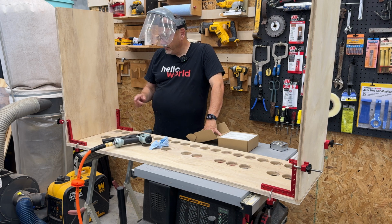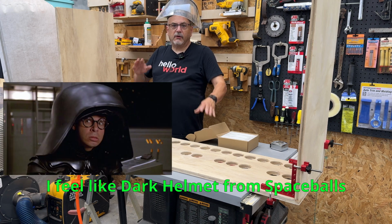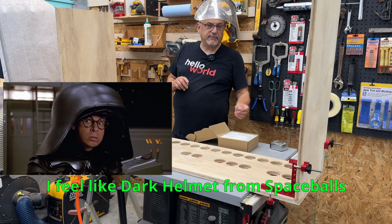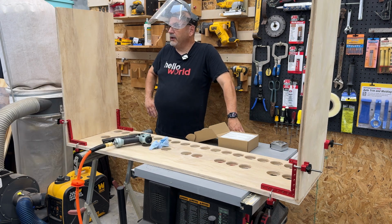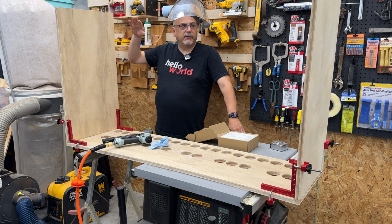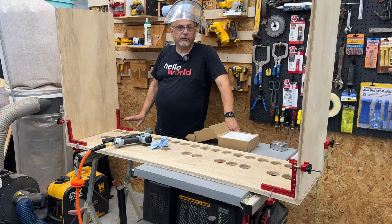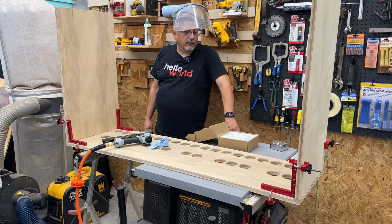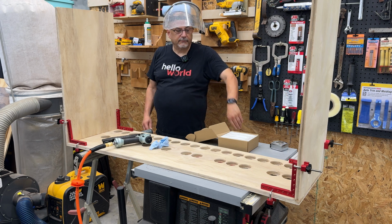While this glue is drying, I'm going to go ahead and hit them with some brad nails just to hold it in place good. Once I get the whole frame assembled, I'll probably put the squares back on it and then actually put some real screws into it. But just for now, I'm going to be having to flex this a little bit to get everything lined up, top and bottom all the way around. So I'm going to wait until the whole thing's put together. Then I'm going to square it really well and get some actual screws in it. But for now, it's just going to have glue and some brad nails to hold it together until then.